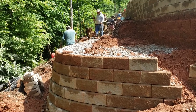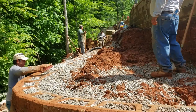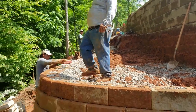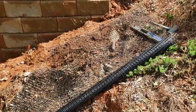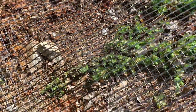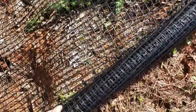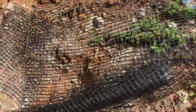They're having to have it redone already. You've got to pack down that footing with a tamper. The other key thing is this geogrid — it's called a dead man — and it needs to go in about every two to three blocks, depending on how soft the soil is and how high you're going.